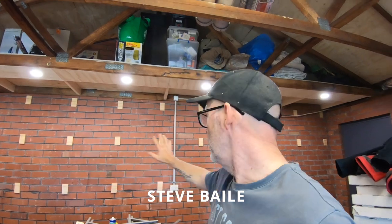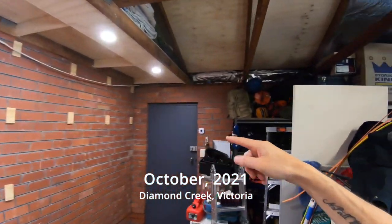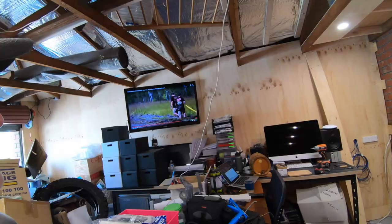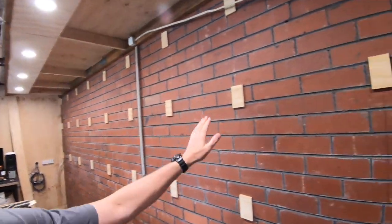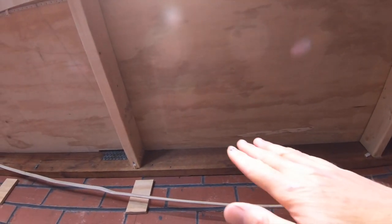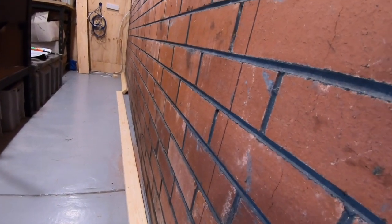What I'm actually doing here is building a wall and lining it with timber plywood panels, exactly the same as what I've done over there already. I've started in that corner and I'm going to work my way around. This one I have to pull the wall out a bit, but I want to run it right up into here so that it covers up that truss and gives a nice neat finish. By doing that it goes 2.4 meters down, which is the length of the sheet, and it'll sit virtually right about here.